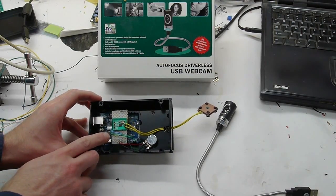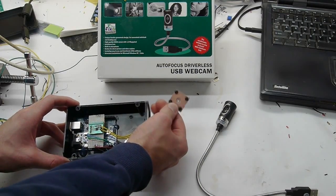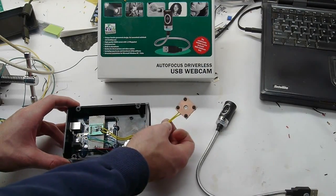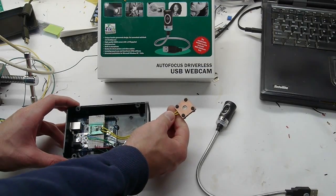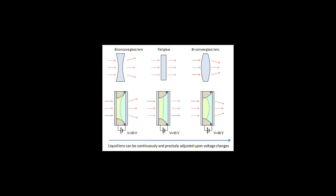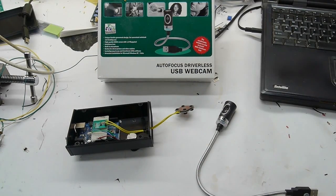This is a liquid lens driver, and this is a liquid lens here. So what's a liquid lens? It's an optical device that can change focal length based on the electrical signal that we give it. It has no real moving parts. It's built by putting a drop of water into an oil liquid. When you apply power to the lens, the water molecules are polarized whereas the oil molecules are not. So when you apply an electric field to the lens, the water molecules are pulled preferentially more than the oil molecules, and it will change the shape of the droplet of water. If the oil and water have different indices of refraction, you get a lens effect. So changing the shape of the meniscus in there will change the power of the lens.